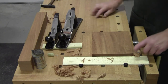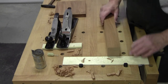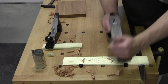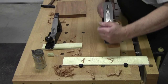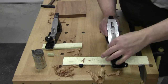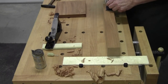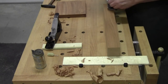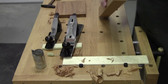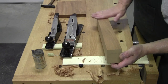I hope that helps a little bit in regards to camber. The wood of the day — the wood we're planing here is mahogany. And no, it's not some mahogany look-alike. This is true mahogany. I'm not going to make a lot of shavings with it because it's a precious wood to me; I don't find much of this. It works beautifully — absolutely beautifully. You get a nice, smooth, polished surface. It is an open-pored wood, like walnut, so if you want a very high-gloss finish, you have to fill the grain.